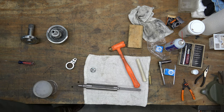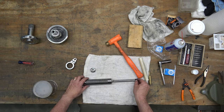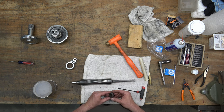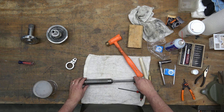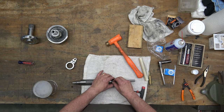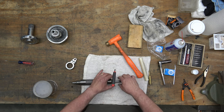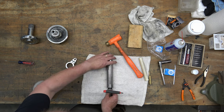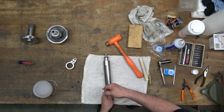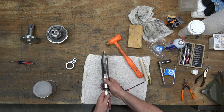Then we've got the rubber washer — you have to have all these pieces present otherwise this is not going to work. Then we have the spindle collar: one side is flat and the other side is convex, so you want the convex side facing away from the quill. Use your thumb to press all that together and then tighten it down with the cone point set screw — there's a recess in the spindle that the cone point set screw is supposed to sit in.